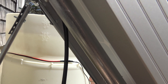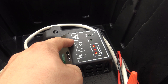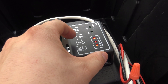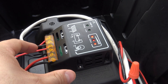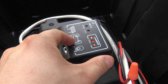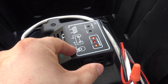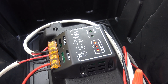As we enter inside this box, let's look at all these wires one more time. We've got the positive and negative running from the solar panel, and those are going into our solar controller — into the positive and negative on the solar controller. That's allowing all of the energy created by the solar panel to go into this module, which regulates our battery and our pump. The next two wires go to the battery itself.